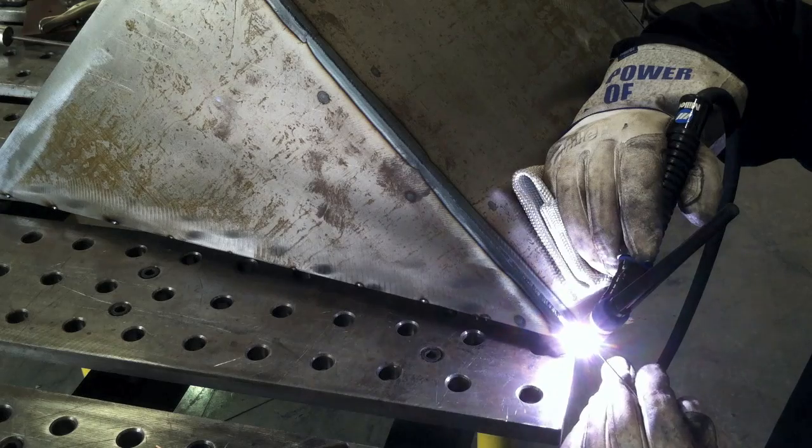Some of these joints have angle iron behind them, some don't, so it takes a little different heat. I'm going to weld to the end — I got a little hotter than I needed there. See how the puddle runs out a little bit further? That's more heat than what I needed. I didn't do that on purpose to show you, but sometimes that happens. Getting to the end here, I'm backing off the amperage, leaving the rod in the puddle right to the end, and then getting off the foot pedal so I don't blow the corner away.